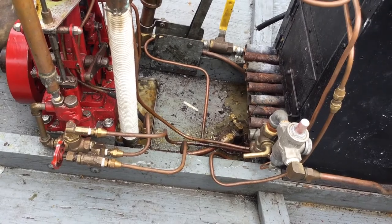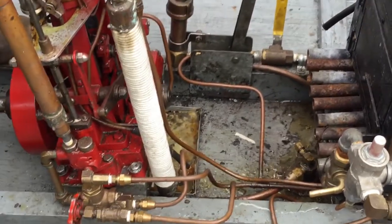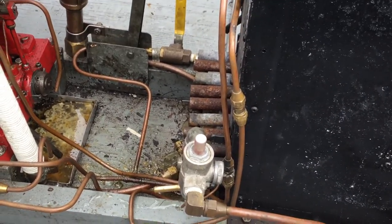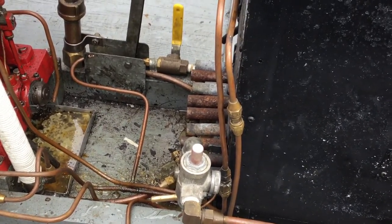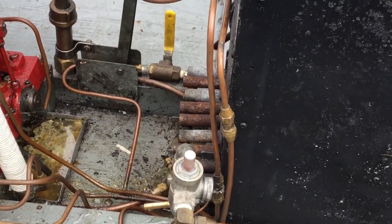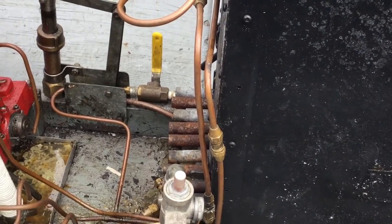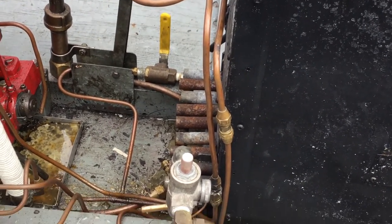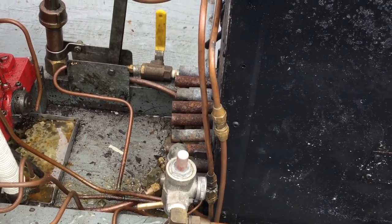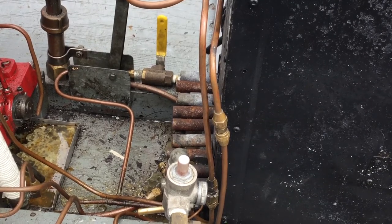Where's the bilge? This whole center is the bilge. You'll probably need an electrical pump — I never had one. With a steam engine, you can't just pump that into the water because oil floats on water — you're going to see a pool of oil. I had to contain it and put it in a five-gallon bucket at the end of the day. That's the nature of steam. If a DNR ever catches you dumping oil into the lake, they'd be very unhappy.